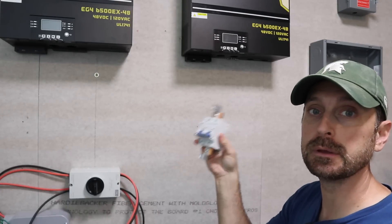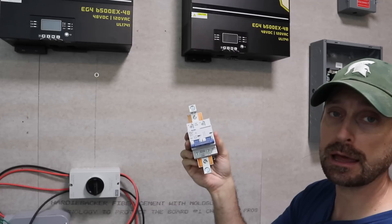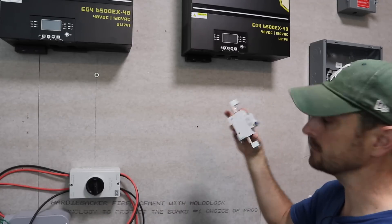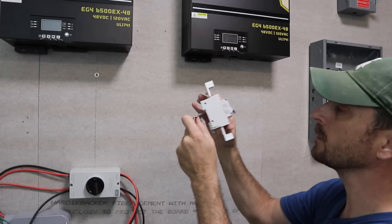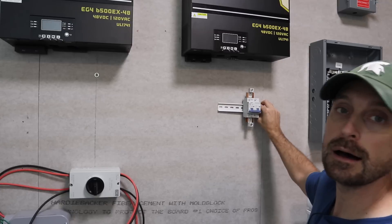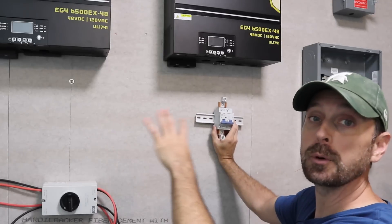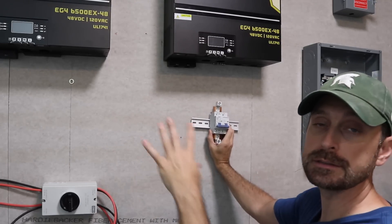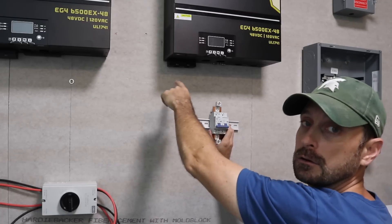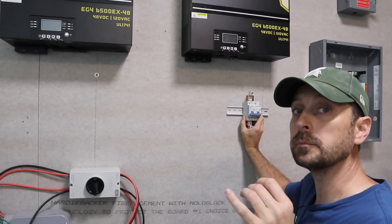I have enough room toward the top of the ceiling to put the safety switch and mount it above the sub panel. Make sure you leave the proper clearance for the sides of your inverters. Signature Solar recommends these 60 volt, 200 amp Nader breakers for your positive battery connections — they're DIN rail mounted, so you'll need DIN rails. Mount them on the wall underneath where your positive cable is going to be. When planning the layout, remember to leave room for communication cables, your line out to the sub panel, and your PV lines in — that way it'll look nice and clean.